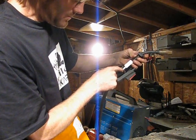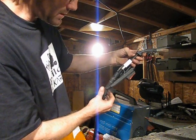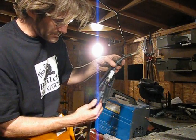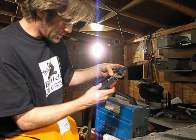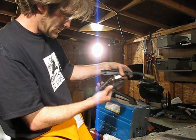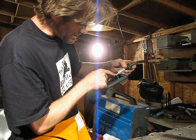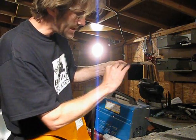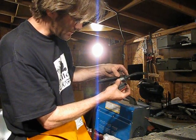Where you see this little white piece, this is your wire feed. Notice there is no gas line. This specific Harbor Freight one is not set up for gas, so you cannot put gas in it. Otherwise there would be another secondary plug-in outlet right here where you'd put the gas in, and the gas would plume out through — but that's not what happens on these ones.